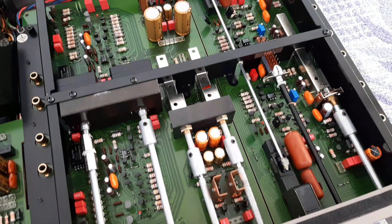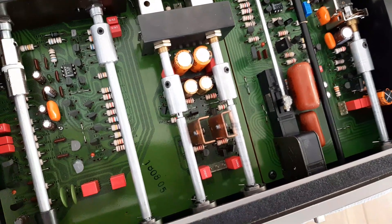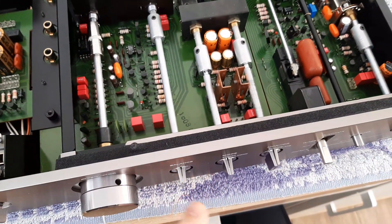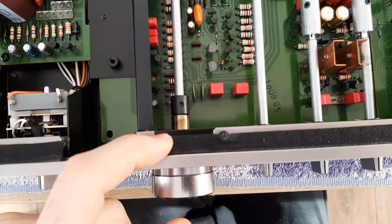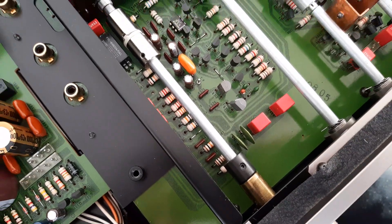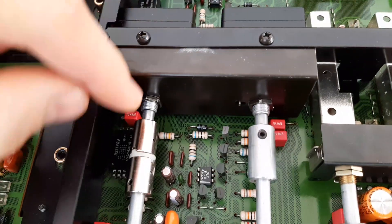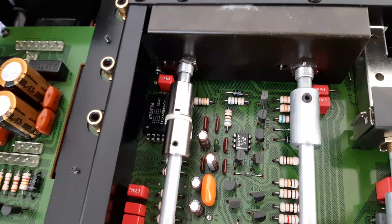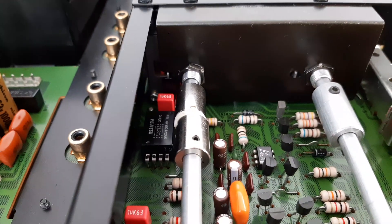The restoration was not so easy because there is also a lot of mechanics. All these shafts here are fixed with some spring wires. The front panel — after you remove the shafts, there are some washers here that need to be greased. I cleaned the old grease on the volume shaft and from the brass shaft support, and new grease was installed. What I really like is this coupling between the potentiometer shaft, the attenuator shaft, and the shaft coming from the knob. There is also a spring inside which keeps all three parts connected.